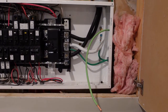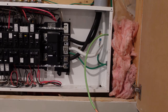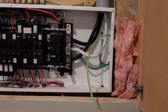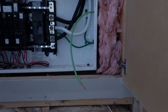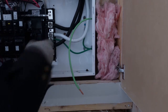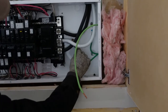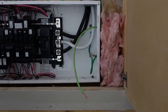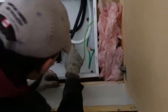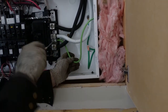Next, we are going to shut the power off and put it in underneath the neutral bar to replace that old one. We do this to take any load off of the main conductors coming in so that we don't cause any arcing or sparking on the main ground. And again guys, remember we're certified electricians, so don't try this at home.